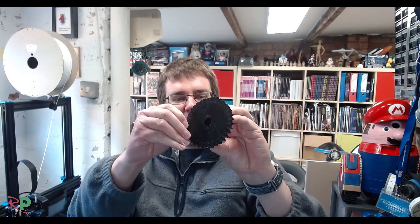Last but not least, this is using the high-stress print settings I showed you. This is just one of the gears — that's seven walls. This one took a while, but I still haven't fully pulled it off the print bed, there's still all the brim around it. But that is solid. You might as well go 100% infill and it would still be just as solid. So that's pretty much the three variations you'd find with the printing.